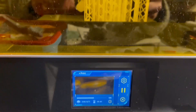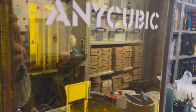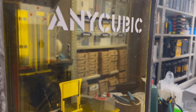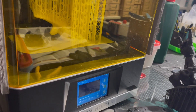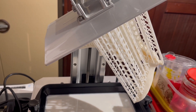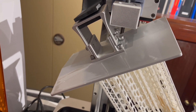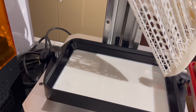To dial in those supports further I've since done a number more prints, including this one here which is actually a full-size print taking up the entire build volume of the Mono X, and it has come out phenomenally. I can't show you it in great detail because it is for someone, but you'll have to take my word for it that you couldn't get much better — I'm very impressed with this machine. The supports removed much easier using a 0.5mm depth and a 0.6mm contact area. Here's one final feature of my resin dripper, and I will add the download link to the comments shortly — as always, if you enjoyed, give this video a like and subscribe.